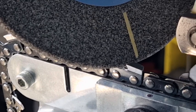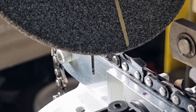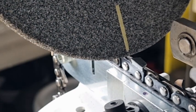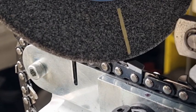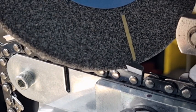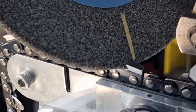Pretty simple — let me go over that one more time. When I put the top plate on zero and align the mark with approximately the point of the tooth — that's lined up spot on — then I move this to the right-hand side to 25 degrees, the tooth has moved away from that center line. The point of the tooth is now about eight millimeters away. That's close enough to 10 degrees downward tilt, because the center line — that white mark — is the lowest point on the wheel, and that's what 10 degrees downward tilt is.